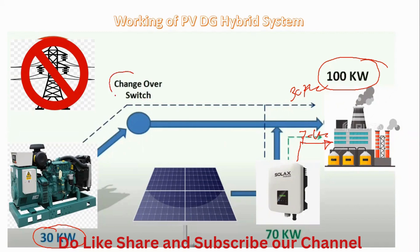The role of the automatic transfer switch: even in a nominal diesel generator set without any solar power involved, the diesel generator will automatically start because the automatic transfer switch senses the absence of reference voltage from the grid and starts the generator.